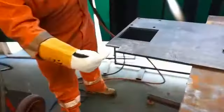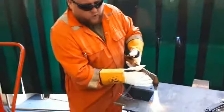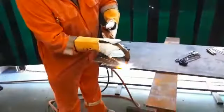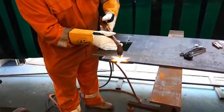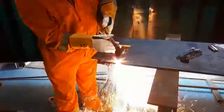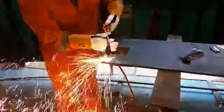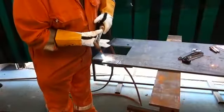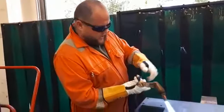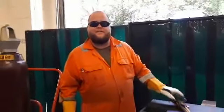Got a nice clean cut on the piece of material. What I would say is: if you want to cut from the inside or the outside, always try and cut from the edge of the piece of material — you'll get a much easier cut. When you're cutting on the edge, make sure the jets aren't touching; you want to have a slight offset of a couple of millimetres. Always make sure in terms of the heat that you're in a position where it's not going to get too hot, because if it's too hot you'll end up burning your hand. So make sure you turn the torch off and keep your hand at a distance away from where you're cutting. Right, thank you very much — I'll see you next time.